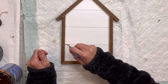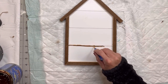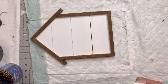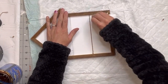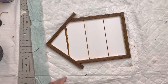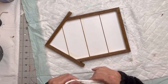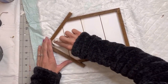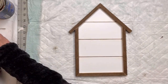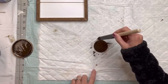I wipe it in with a piece of paper towel — that just removes the excess gel stain. Next I'm going to take some gel stain on the back. This is almost like a shiplap; it has little grooves and I'm going to apply the gel stain inside the lines. Because this had a sheen to it, I was able to easily wipe off the gel stain since it had a slick surface. If this was regular wood it would not do this — it would just absorb it — so just keep that in mind.